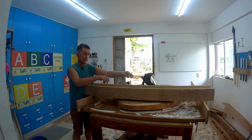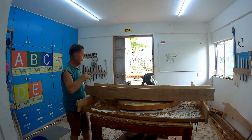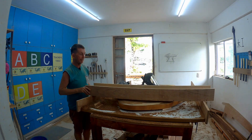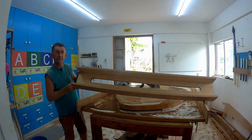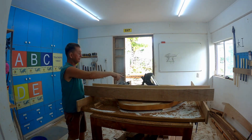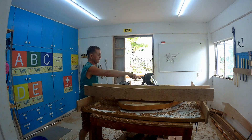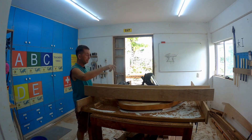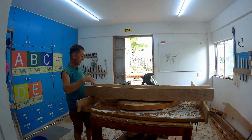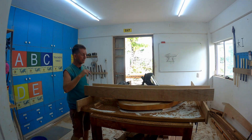When putting shims under this, make sure the shims are all exactly the same size when lifting it up, or else you'll be cutting out too much. I made the sled from plywood as well. I brought it very wide on the side so I'm putting the router in sideways with the handle on both ends - otherwise the handles will hit the sled. I know that from my last one. This is going to be the bottom of the slab, maybe the top - I don't know yet.